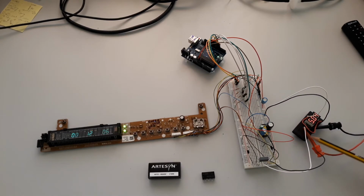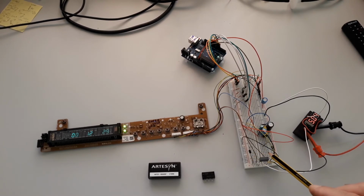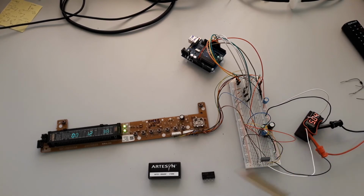And I have only 5 volts at the input. This 5 volts polarizes the filament directly, okay? The filament is connected directly to these 2 wires. Normally I use diodes, but in this case these 2 diodes present here are not used. I can remove them, it is not necessary, okay? Because this panel has 2 serial resistors between the wires of the filament.